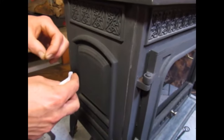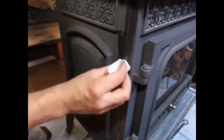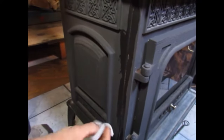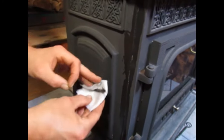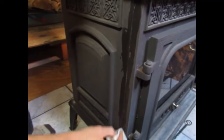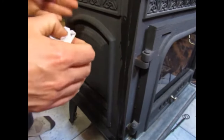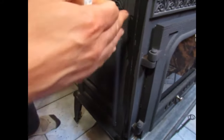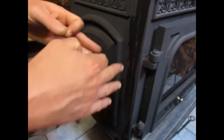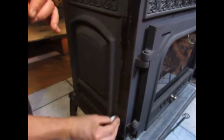On the tube of cement, it says that you must clean the area first, so you just want to find your seam, go through, give it a good wipe down. You can use your nail through the paper towel or washcloth or whatever you choose to use. Kind of use your nail and get it right in that groove. If there is any hole, which in this wood stove there are, a lot of debris and dust and dirt and all sorts of stuff gets sucked into these little tiny holes, and the cement isn't made to kind of stick to that. So you go through, give it a good clean,